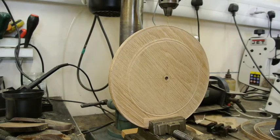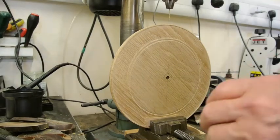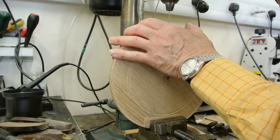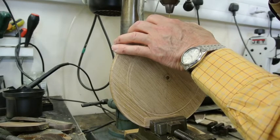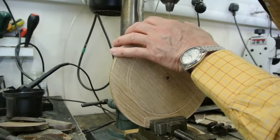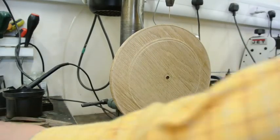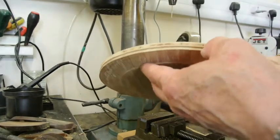I just have to get the drill to line up with the same spot on each, and I should be able to get the pins that come out extending the same direction so it looks even when I've finished. I've pre-drilled a centre drill mark so I should be able to get exactly on the right spot, which is midway between the groove and the edge. I've set a depth stop of 10mm. That's fairly straightforward — I should be able to do that for each one. Here's the final shape, all drilled out to 10mm.